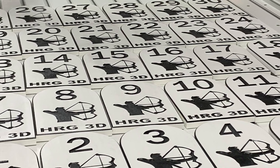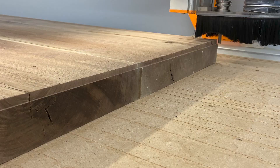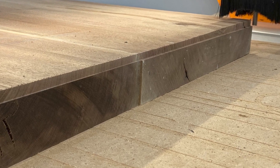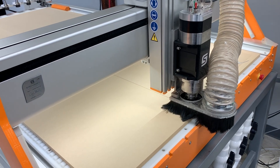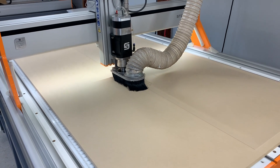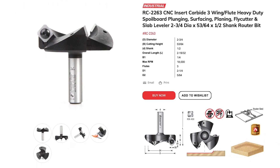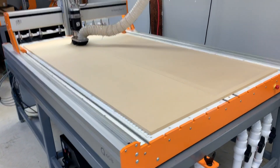The system is designed for efficient, high flow of air, which is important when using an MDF spoilboard. On many jobs, you'll want to pass the cutter slightly past the bottom surface of the material to ensure a clean bottom cut. In order to effectively do this, an MDF spoilboard is used. After removing around one millimeter of material from each side using a spoilboard cutter, such as the Amanatool RC2263, the MDF becomes very porous, allowing air to flow easily through the material.